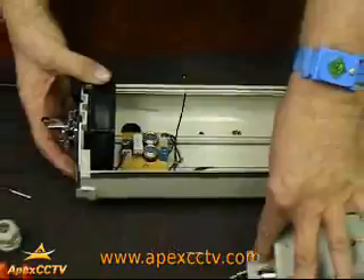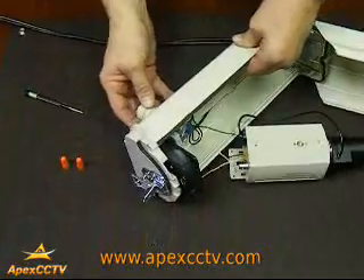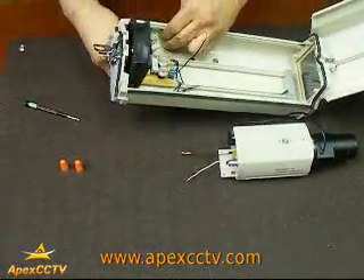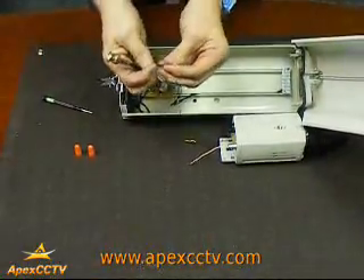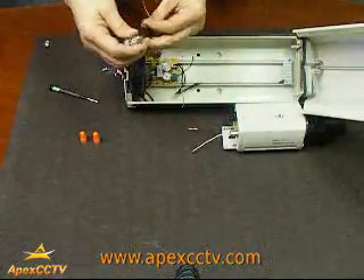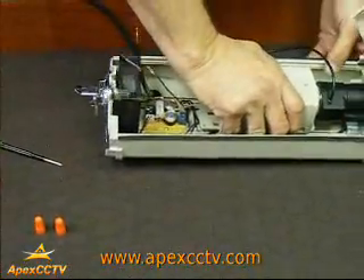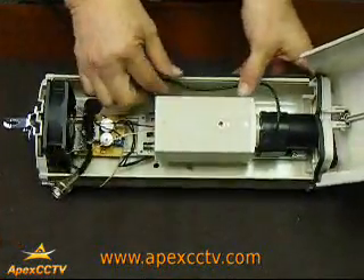You have the wires to the camera. Also make sure that the waterproof plug is installed in the bottom of your camera box — this is where your camera line comes in through the bottom. This has your power; you'll also strip these wires and your video feed is where you put your BNC connector on. Next, take the camera itself and it snaps inside the rail. Make sure it doesn't hit any wiring when you attach it.